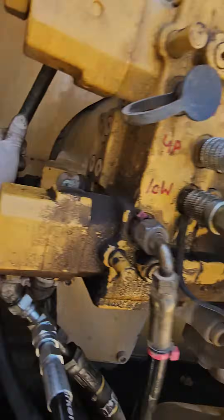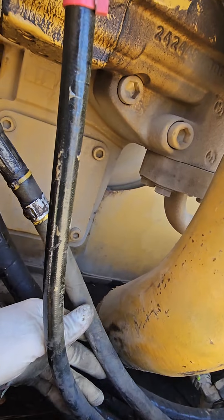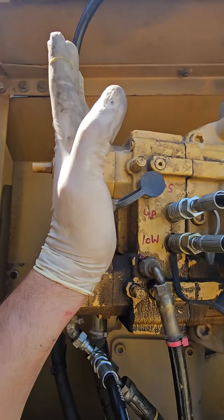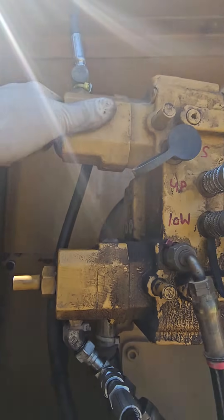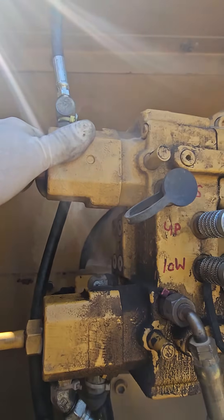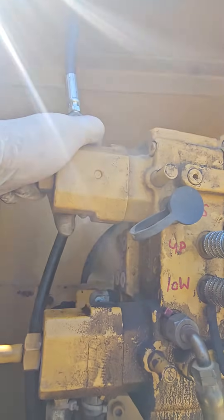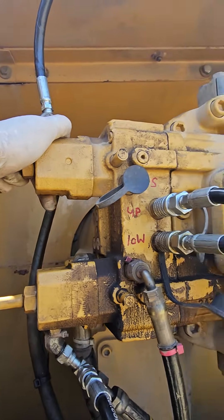You've got your pilot lines that are not part of your pilot system but a separate bleed system — the two lines I was making a big deal about earlier. Basically, if the need increases, the whole system will de-stroke the axial pump, which increases pressure and decreases volume. So you can't move as fast but you increase pressure — it's a balancing act between need versus demand, done without any kind of electronics.